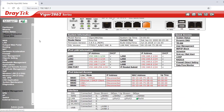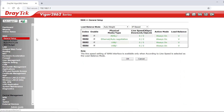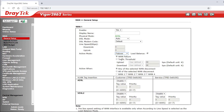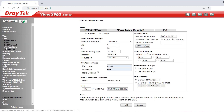The online status page shows details of any connected WANs. If connected to ADSL or VDSL, you'll also see the signal-to-noise ratio at the bottom. Under WAN general setup is where you configure load balance or failover — set to always-on or failover with load balance options. The internet access section lets you get into the details of each WAN. There's also a WAN budget option, and LAN details covering your DHCP server.